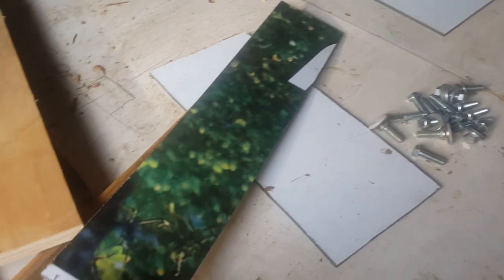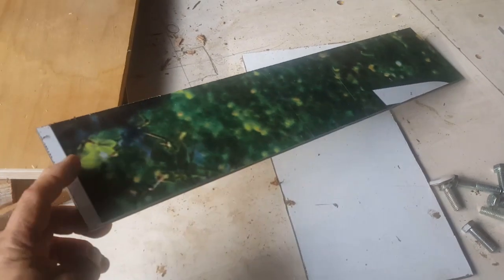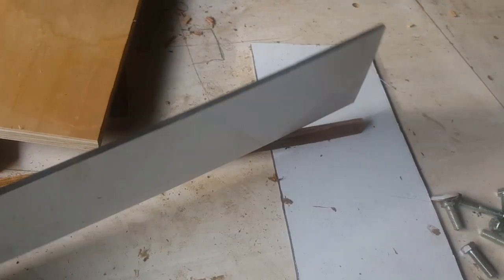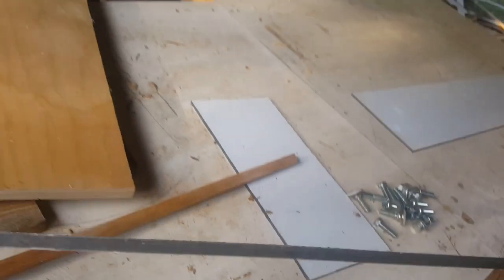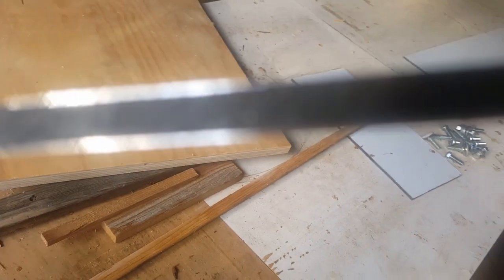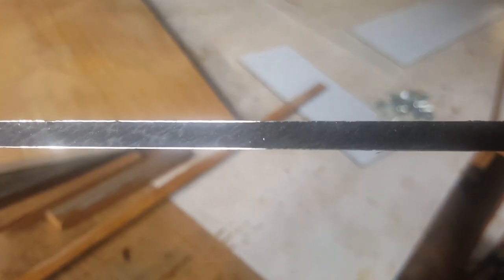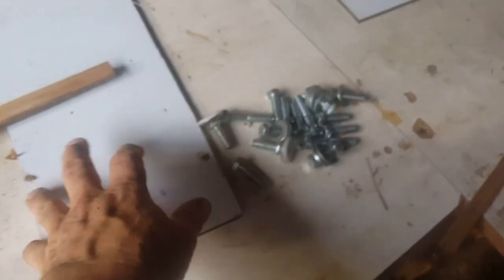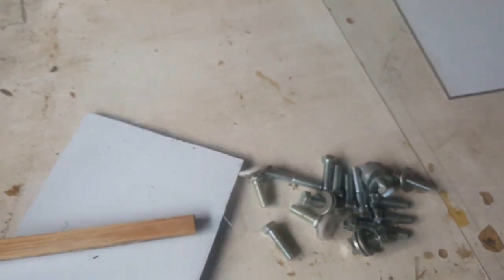Let's take one more closer look, a little slower, because this is really important. You can go to any sign building company and ask for this — they'll have bundles of it in the back, rejected signs or signs that were never picked up, and if you're nice enough they might just give it to you. See that beautiful shiny silver — that is aluminum on both sides with a solid resin interior. It's not medium density board with plywood inside; this is high density, a quarter inch.